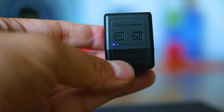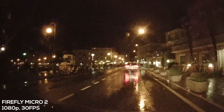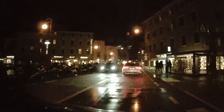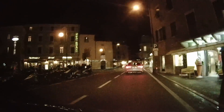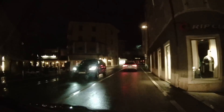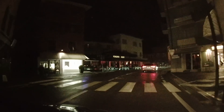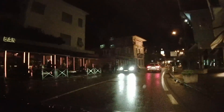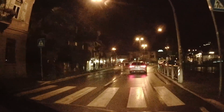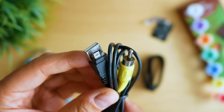There are ways to fine-tune the picture and settings, but it can be a little challenging — and this is where it may attract enthusiastic drone fans. The camera supports FPV, meaning that if you add a transmitter, it can stream in real time to FPV goggles. Quite notably, Firefly promise around 40 to 50 milliseconds of delay, which sounds quite awesome. It can also measure external battery voltage in real time and show it on the OSD without additional components. But in order to enable any of these, you will need to access the configuration menu.